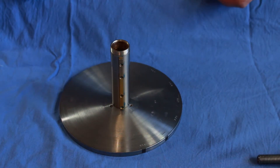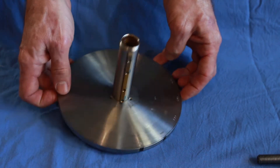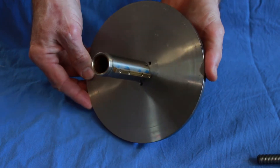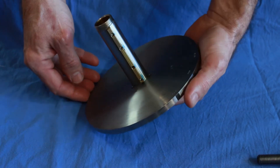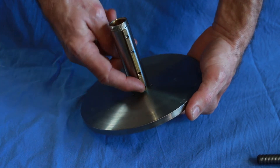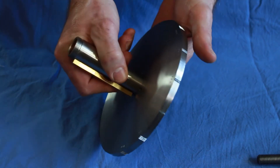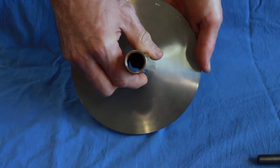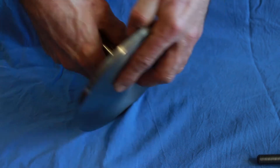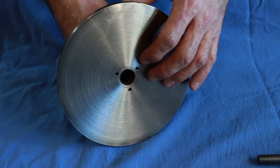Just to go a little bit into detail here - we have the crossing wheel and the rosette barrel fitted together. You can see on the barrel, I've got a key right here. The barrel is press fit into the wheel. And the barrel itself has got two bronze bushes: one in the front here and one in the back, which are press fit into the barrel.